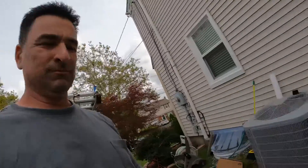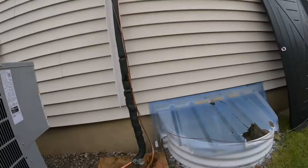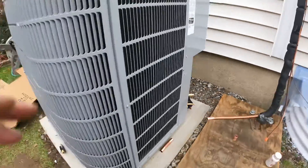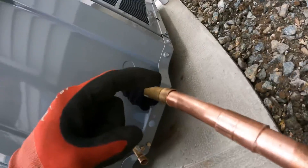Hey, what's going on? It's Bill, the HVAC Hacker. Today my luck ran just a little short. I almost had the perfect length, but how was I gonna know when I first ran it? I just left it down here. So I'm running this line set from up there, tied into the air handler. Only had that little piece left — it was a good run, but now look over here: that almost is perfect, and then I can move it there. But the problem is if I tried to move the condenser, I'm no longer gonna be centered on my path, and I've got a little that way to go but still not enough — see, a little bit of a gap.